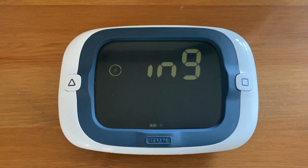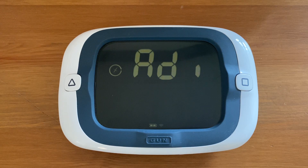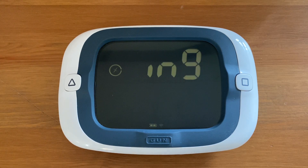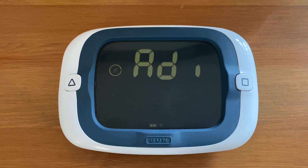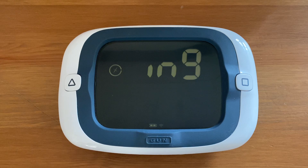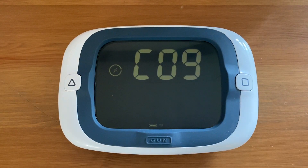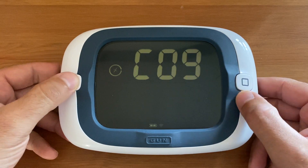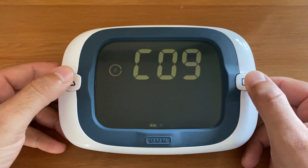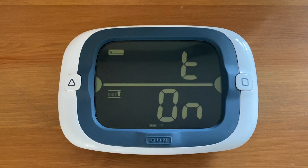This menu is direction output. It changes the direction output in race mode. You have two options: heading, or magnetic compass — the direction you're pointing — and course over ground, or COG, which is the direction you're moving and is GPS-based. Toggle between heading and COG using the line set buttons, and save your selection using the gun button to go to the next menu.